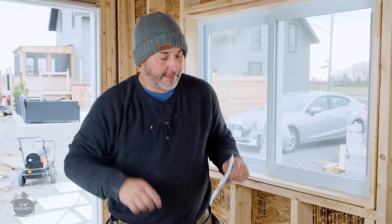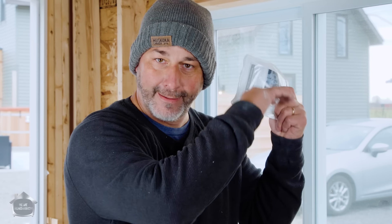Now we should talk about the roll-up garage door — these things are a pain. The ones we bought didn't come with instructions, so the only way to sort out how to install it is to actually roll it out on the ground, put everything together on the floor, then get your rough dimensions, and then build the hole completely backwards. Most things you buy in this world give you a rough dimension for installation, but in this case we've got to do it backwards and kind of reinvent the wheel.